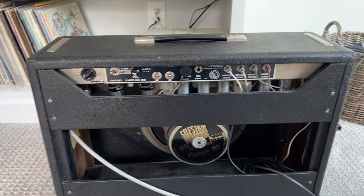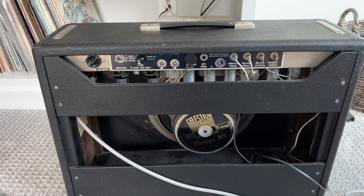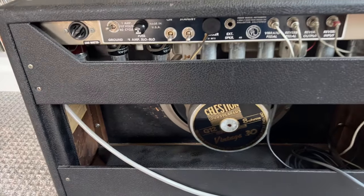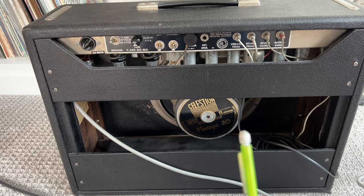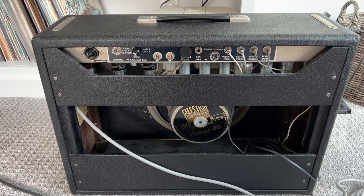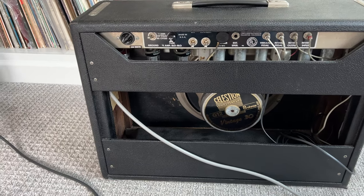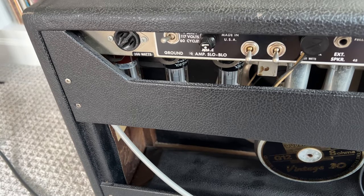You didn't get to see it, but basically while the sound was coming out of the amp, I pulled off the covers carefully and pressed on each tube with the end of the pencil. We don't want to get shocked — if you feel uncomfortable with this, take it to a tech. You especially want to be careful getting near the rectifier and power tubes.